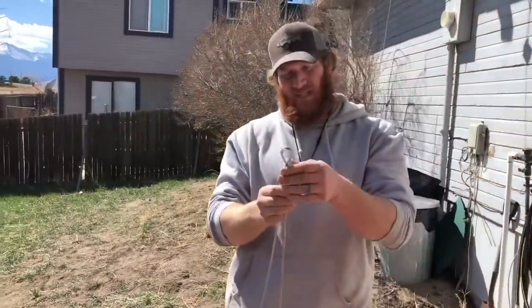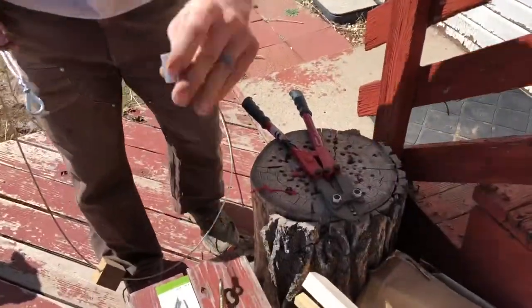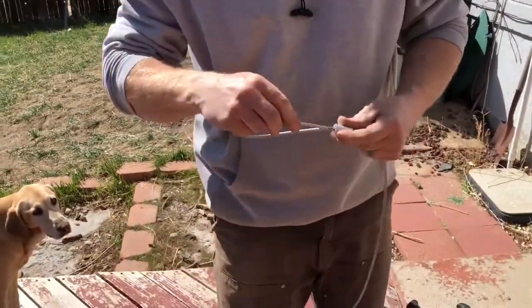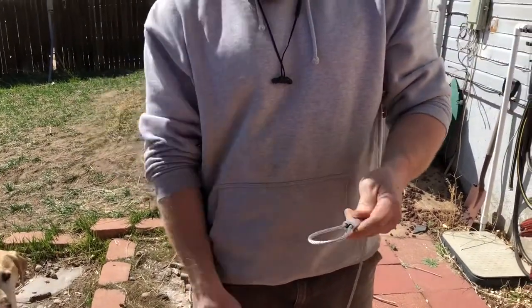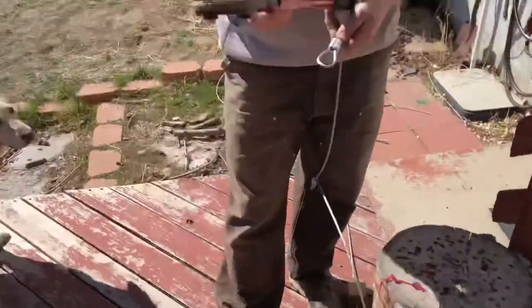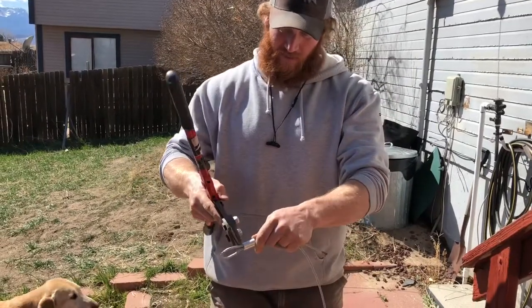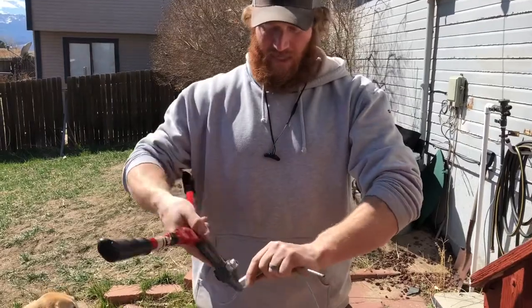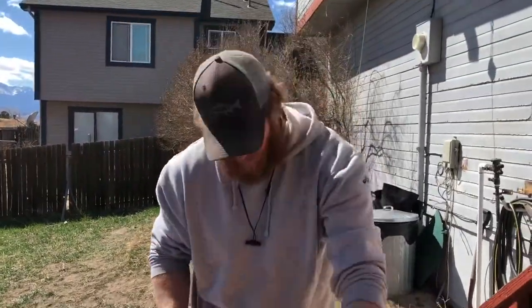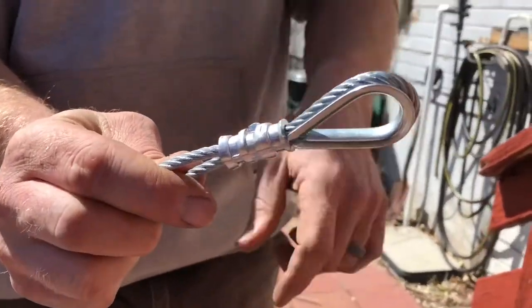For the other end of the cable, I have a set of swaging pliers and the right size ferrule — this one's actually for a quarter inch, this cable is 3/16ths. You feed the cable through like that, insert the thimble in here — this keeps the loop of the wire open instead of letting it kink. Then with the swaging pliers, for 3/16ths you slide it on there and crimp it on the outsides and then the one in the middle. This is the next size bigger, but you can see here the 3/16ths has been swaged in three spots and that clamps the cable.